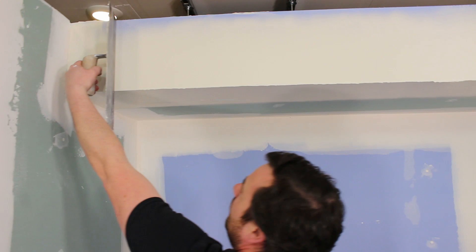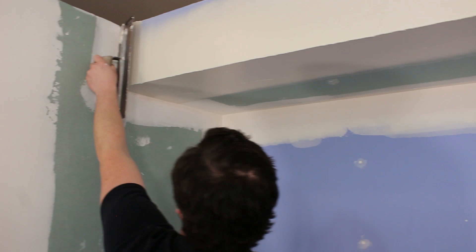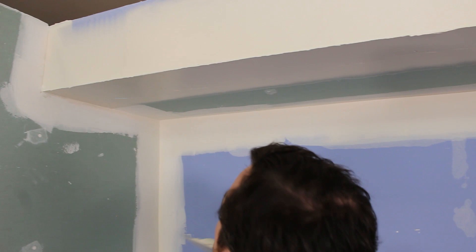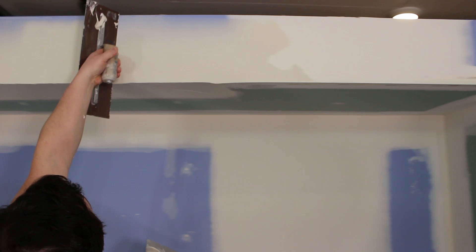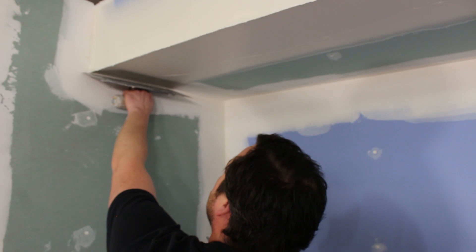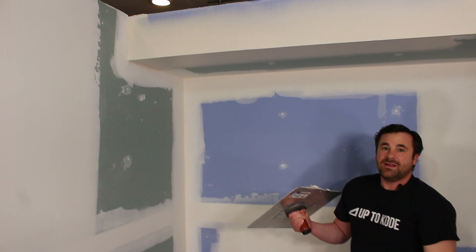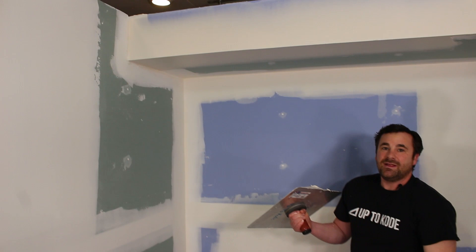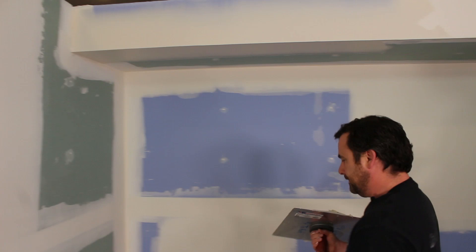When you're doing your first coat, I always like to hold my trowel as square as possible. I want to keep the mud nice and straight. If I go flat, my trowel has more flex and I'll actually dish the mud out — I don't want that. I want it nice and square and flat. So once I get past that corner, I try to hold it as square as I possibly can. That helps me stop chatter.